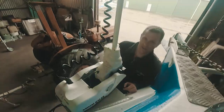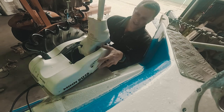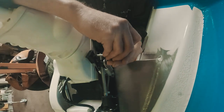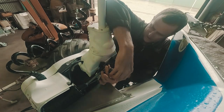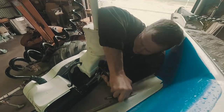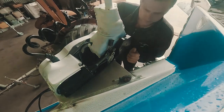Running through the manual stow — not deploy, stow. This is if things go wrong. If it's stuck all the way down and you want to lift it back up so you can travel home, here's what you need to do: take this side cover off — there's just two screws on the side. Remove the screw on this black arm. This is all going to happen on the water, so don't drop anything. We just need to flick this black arm up.